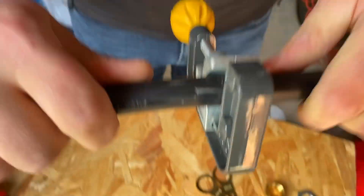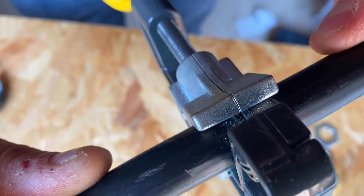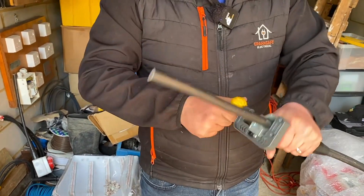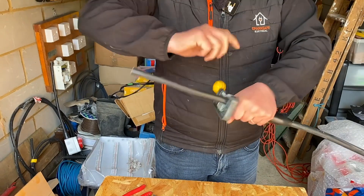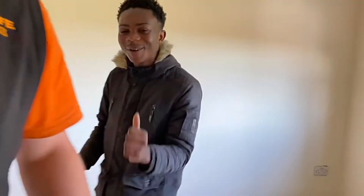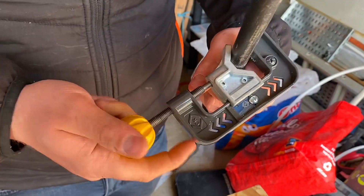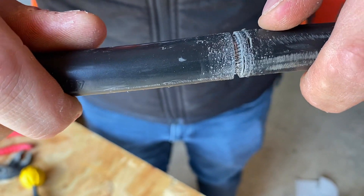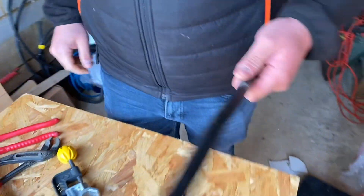Can I just have a little close look at what's happening with that blade? You can see it in there - you can see bits of metal. The beauty of this is you're cutting all sides of it at the right depth at the same time, whereas with a hacksaw you can tend to do the top really well and then the bottom you don't. And especially with your hacksaw - how sharp it is and how much you need to go in. So I'm going to say that's probably enough now. That's through - pretty much through feel and judgment. You can see there how I've got a nice score all the way around, whereas normally with a hacksaw we're looking for the bits we've missed.